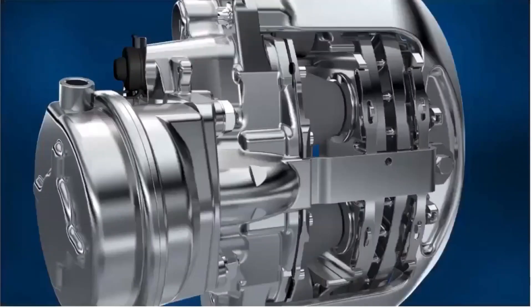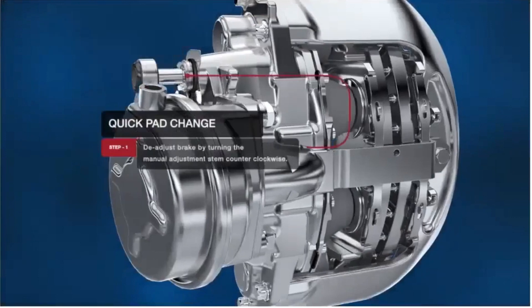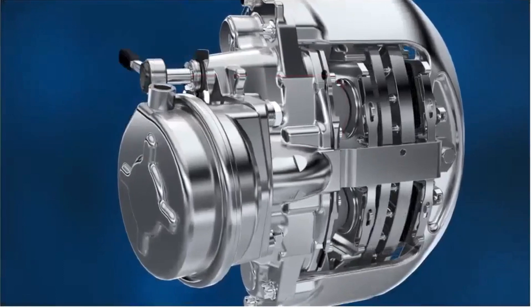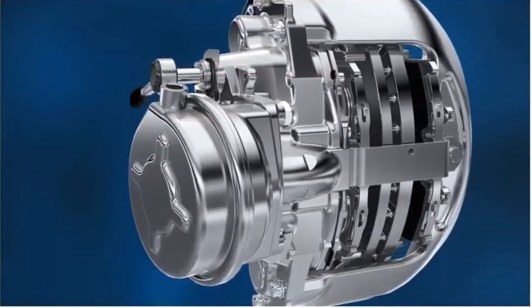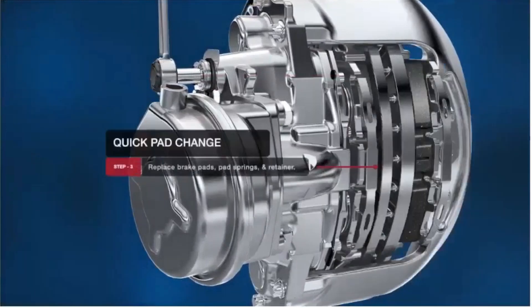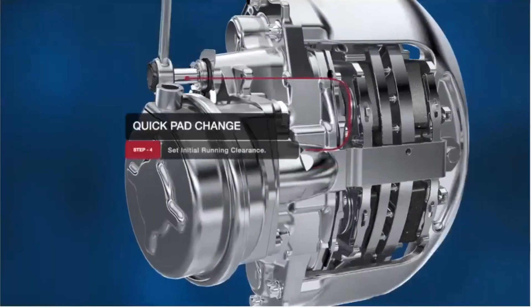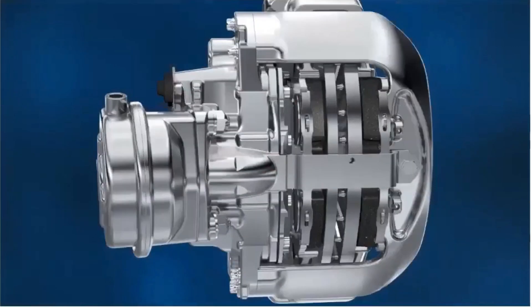In this video it shows you how to do a pad replacement — a quick pad change. We're going to back off the unit. Remember we've got to back it off all the way because we're now going to put new pads in which are thicker than the old pads. We back that all the way off, take that retaining bar off, remove the clips, remove the old pads. Put the new pads in and reassemble it. Put that retaining bar back on, then just adjust it up and back it off a half a turn. We've set our clearance — that is an easy pad replacement.